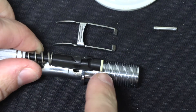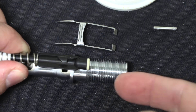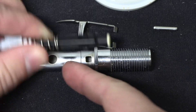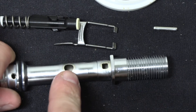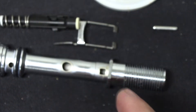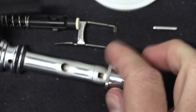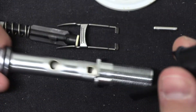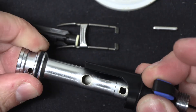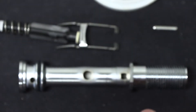When the lever gets pressed down it pushes this backwards — not much, just a tiny bit against this return spring — but just enough for this to pull back. Air is coming in here from the low pressure hose, and once this opens, air continues around it through this tube and comes out this hole, which drops right into the middle of your regulator. And it is that hole that this little plastic wing is going to either cover or not quite cover — so that's how your surface mode lever operates.